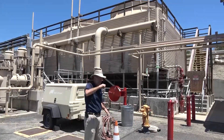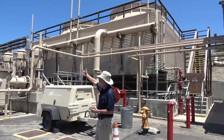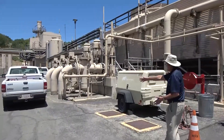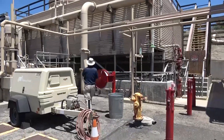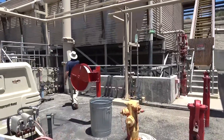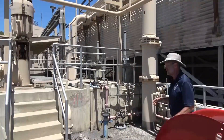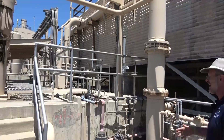At the same time, the water moves downwards. The water has picked up a lot of heat from the condenser, then gone through underground pipes and comes all the way back. If you follow this pipe right here and its twin on the other side — remember there's an A and B associated with this system — this is where the warm cooling water comes back from the condenser.